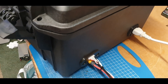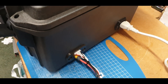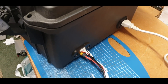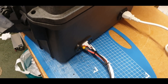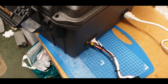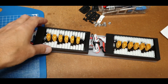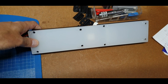They're actually wired in parallel - I had to think about that for a minute. They're wired in parallel so they go back to the charger, and the charger then just sees the connected packs as one large 4S pack of a larger capacity. So what I did was buy the usual XT60 charge board balance boards.